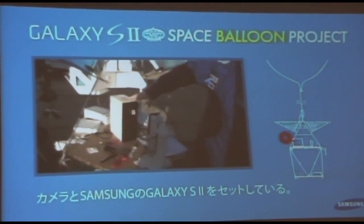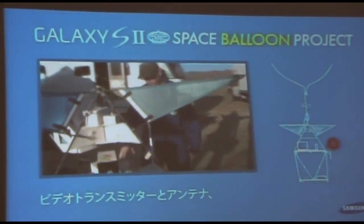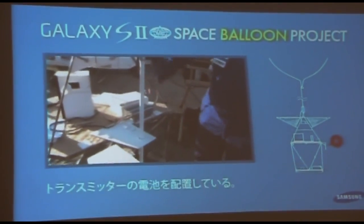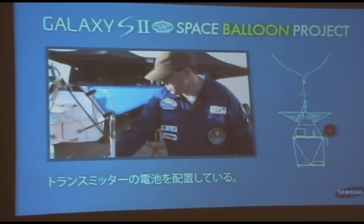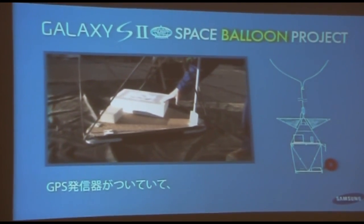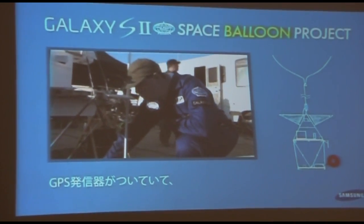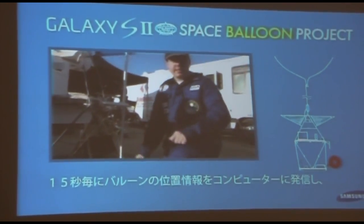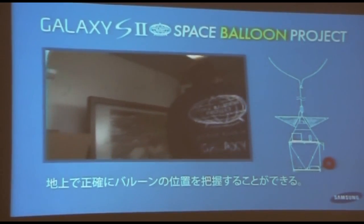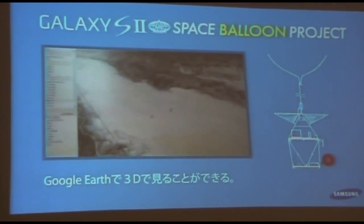This is Samsung's camera setup with the phone, and over here we have the video transmitter. The antenna, and in this box here, is the battery for the transmitter. We also have what's called our tiny track system — inside here is a GPS unit connected to a small microcontroller that transmits through a two-meter radio every 15 seconds, sending the vehicle's GPS coordinates. I'm going to feed this into a computer, which I'll show you in a few minutes, that translates the data into real-time on a 3D map on Google Earth.